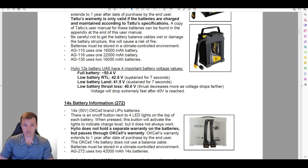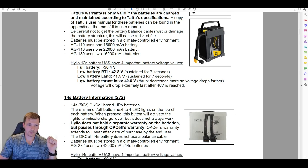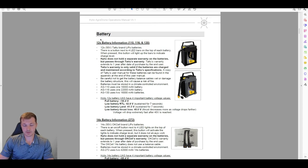The one exception is if the drone is over a pond or over people — then maybe it's better to fall out of the sky 20 yards to the right. That's your call. The last level is 40V, which is the thrust loss limit. Once below 40V, the drone can't really keep itself in the air — that's barely enough to keep the motors running. The drone will start rapidly descending and, with whatever juice it has left, try to stay flat so it lands flat rather than sideways.